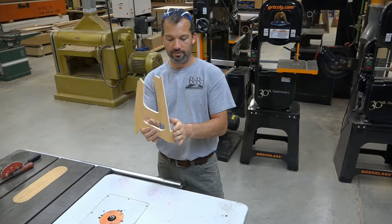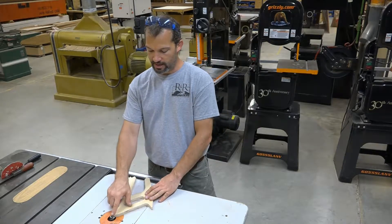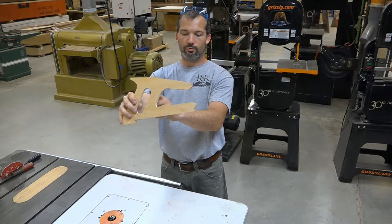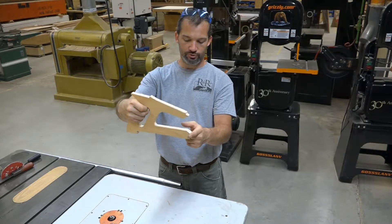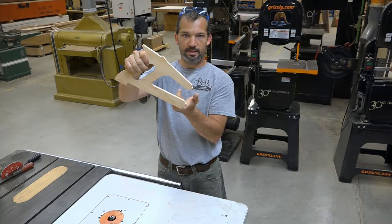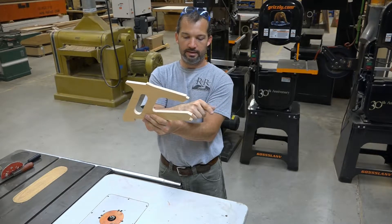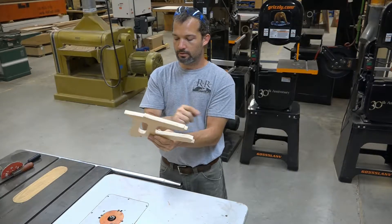This edge should not be routered, neither should this edge — the whole bottom side should not be routered. If it helps, you might want to start at that point so when you finish on the other point, it's easy to know where to stop. I'm also not going to router out my 90-degree push joint, because when you push a project through the table saw, that edge holds it against your project. So I'm going to start routering here, go all the way around, and finish right after that point — it's kind of an easy place to know to stop, because otherwise it's really hard to wrap around that corner.